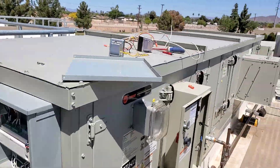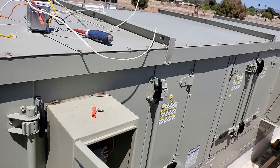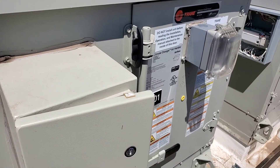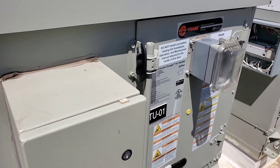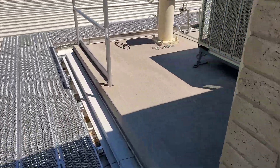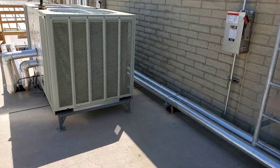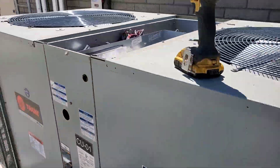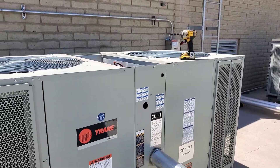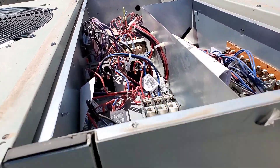The only thing I noticed doing this - if I turn off the power up here, it doesn't stop the unit below. But that's how these are normally wired - the transformers are in the condensing unit. So if somebody turns off the air handler power, the condenser can still run. They both seem to be staging on their own now - one compressor in each, lead-lag to cool the rooms. The rooms just have variable frequency drives for some two horsepower pumps and a bunch of other stuff in the electrical room for this water treatment plant.